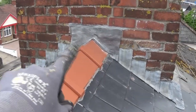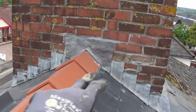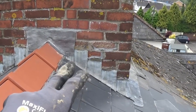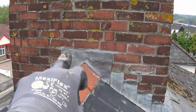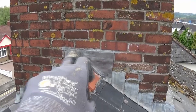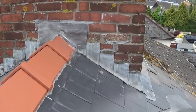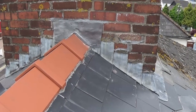Anyway, that's that finished. I beat that into place. I put those two trims on either side, just cut into shape — that's just to stop it flapping around because it's quite a deep piece of lead. If you get a bit of wind over here, which it is quite exposed being on the very top, it might flap around. I've put the lead sealant in there, gone over all the lead nuggets that I put in. That's a nice job now, nice and secure. It's watertight underneath anyway because there's lead underneath the slate, but I've done it just to run the water over the top of that ridge tile.